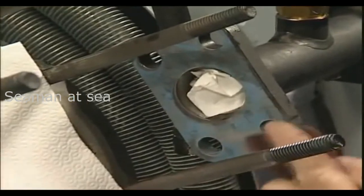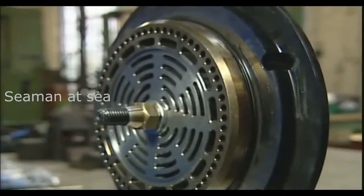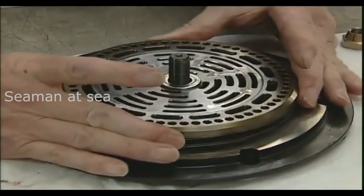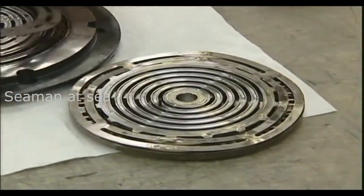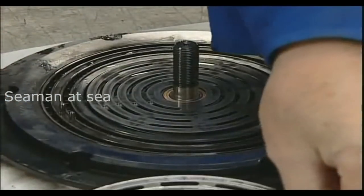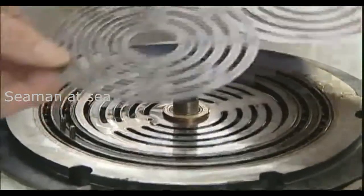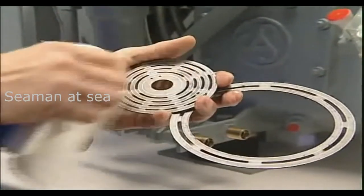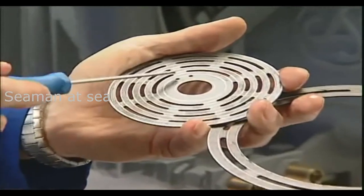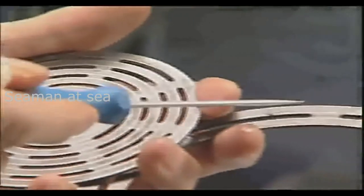The concentric valves are combined suction and delivery valves. The suction side is located on the inside; the delivery or pressure side is the outer annulus. The valve body consists of the upper part, the lower part, and the internal parts. These internal parts consist of a valve plate and corresponding valve springs for both suction and delivery. Valves are among the parts with the greatest stress in a compressor. However, slight markings can occur after only a few operational hours and do not impair the function of the valve.